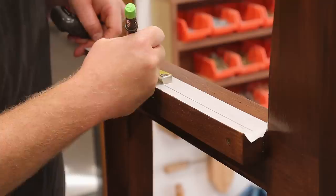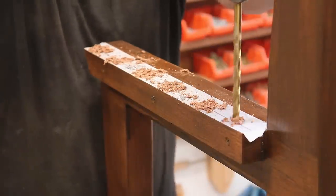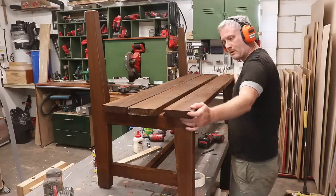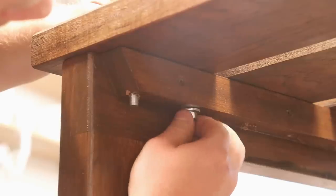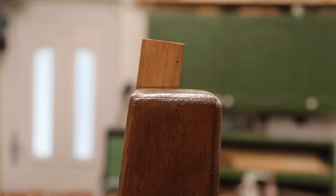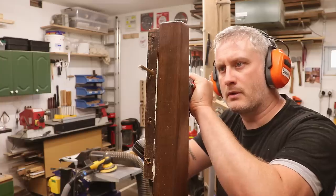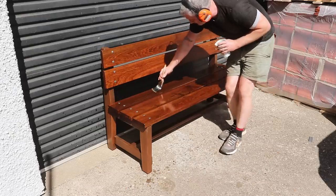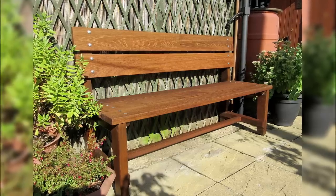To fit the slats I carefully measure and mark up where I want my holes, making sure all of the fittings will be equally spaced. I've got some M8 bolts to fit the slats — it's just a case of positioning them where I want them, drilling the holes and adding the nuts and washers. Then I fit more cleats to support the backrest slats and fit those in the same way. When everything was assembled I gave it one last coat of oil, and that's it done. It's pretty comfortable to sit on and here's a picture of the bench in its final home in my mum and dad's garden.